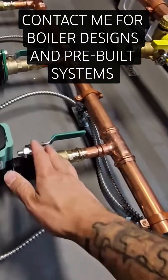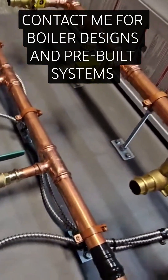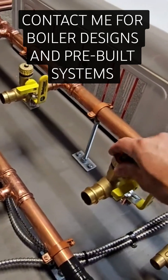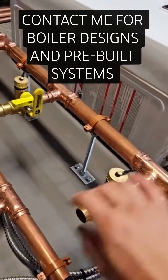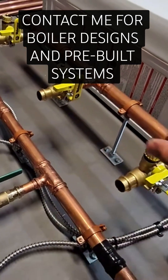You can just shut these off, pop the new pump in, and turn them back on. If it's a baseboard system, I always provide these shutoff valves with drain fittings on them as well, so that you could bleed each individual loop or baseboard loop.